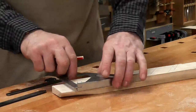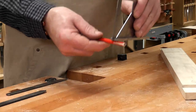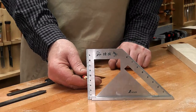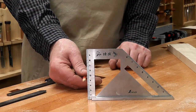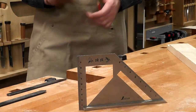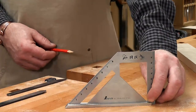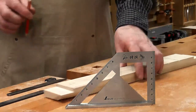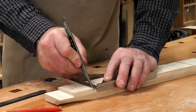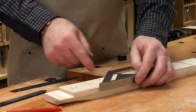One complaint I have seen is that the scale, which is in metric down on here, starts at the bottom down here. That's great actually for a couple of things. If you're going to put it on things like a saw table or saw bench, or you want to set a height for a drill bit coming down, you've got your height. I've used it on a table saw, where I can put it next to my blade and set the blade height I want. Great for that. If I want to do a 45 degree angle on my saw table, I can use that to give me accurate setup. All right, so those little things really appeal to me. I love the fact that it's wider, easier to use. Get in there, put it across, okay? Nice scale, I've got a scale on the other side, we can do a mitre.